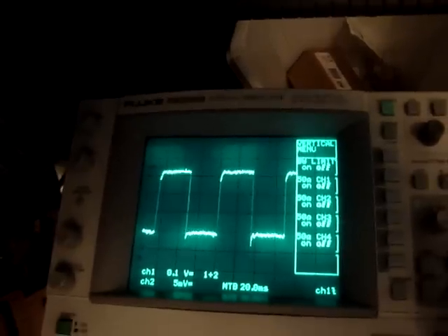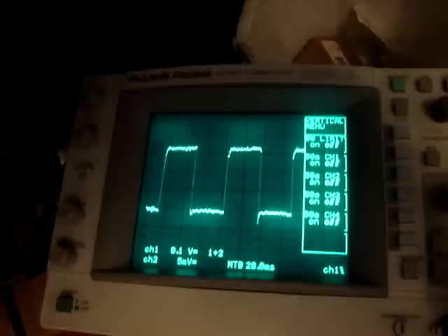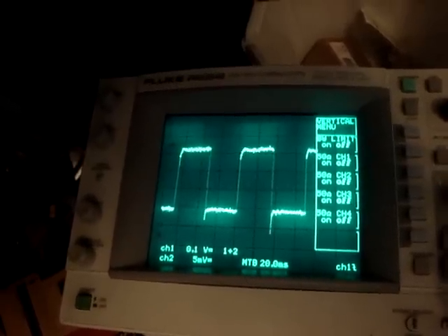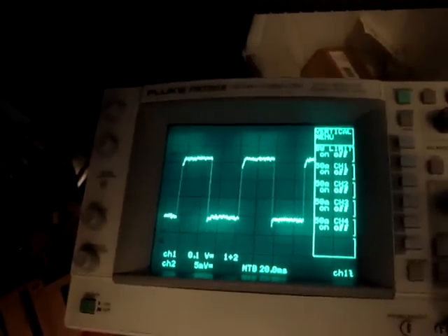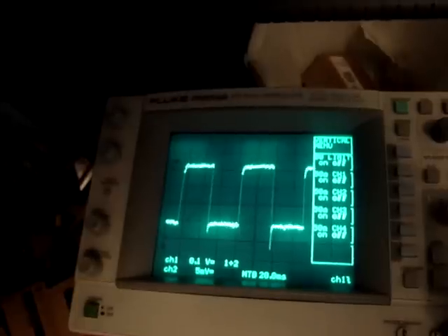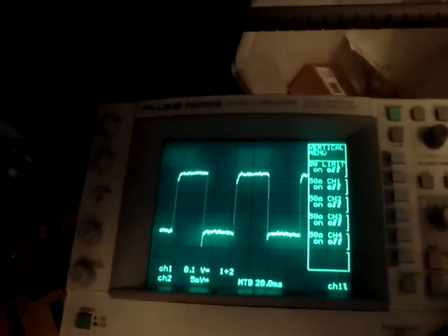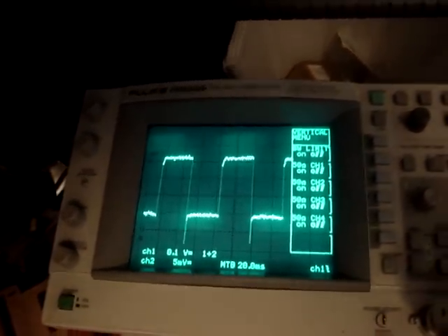I have no real explanation why — well, I have some ideas. Depending on where you close the contacts and where the magnet is in position to the coil, as it's going away, it looks like the induced CEMF and the voltage delay going down in the coil cancel out, and you end up with zero effective current CEMF in the coil.